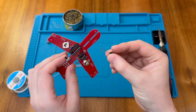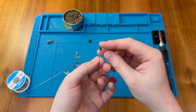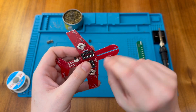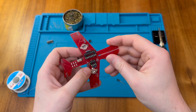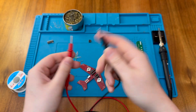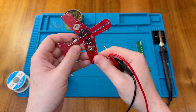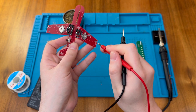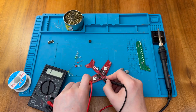Next let's do our electrolytic capacitor. The positive is on the longer lead, the negative on the shorter lead, and there's also a negative symbol on the can. The square pin on the PCB represents the positive side and the hashed area the negative side. I'll verify with a multimeter in continuity mode to confirm the negative side of the battery connects to the negative area on the capacitor layout.